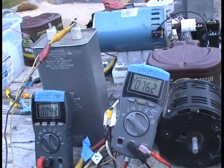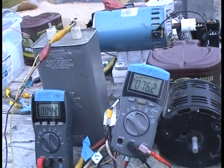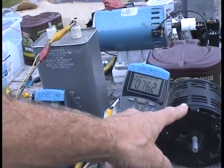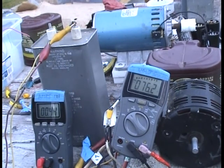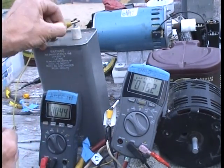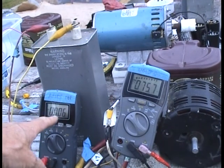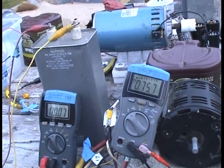Here's how you get it to run. Right now I have the roto-verter motor running, drawing 0.44 amps. I don't have this AC motor plugged in yet, but I do have the grid voltage kicked down to 76 volts with this Variac. As soon as I take this red wire and connect it in here, I'll have the AC motor connected. Now look at how far down that dropped — it's working as a motor because the roto-verter motor doesn't have to spin anything more or less. Now you know it's working.